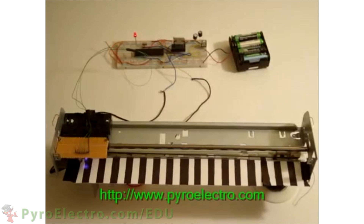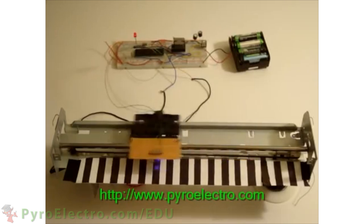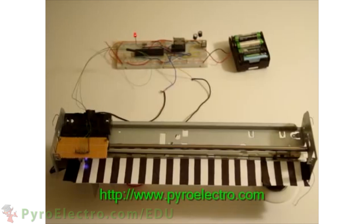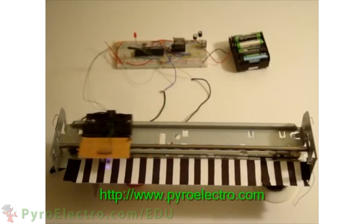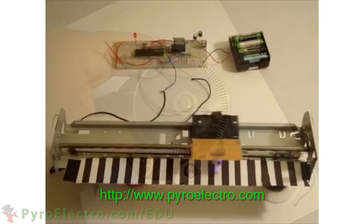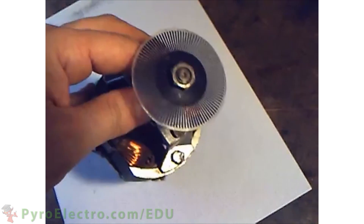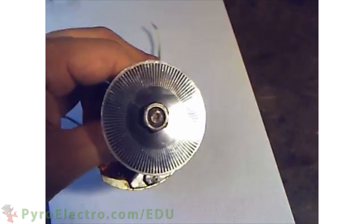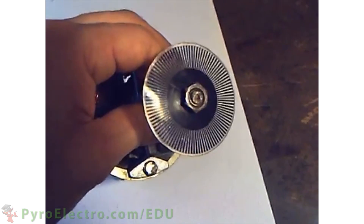In the real world, encoded feedback using infrared sensors is very common. Printers use them to move inkjet stages to exact locations with submillimeter precision. The precision you can achieve depends only on the quality of your encoder. This is an example of an inkjet printer I repurposed with a lower quality encoder to show as an example for linear encoding. Another type of encoder uses transparent segments for a sensor to look through instead of reflect off of, but the feedback methodology is the same — it also creates an on-off pulse that a microcontroller can use to track distance and speed.